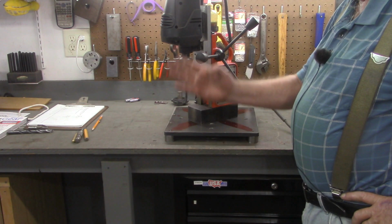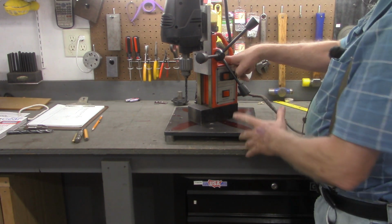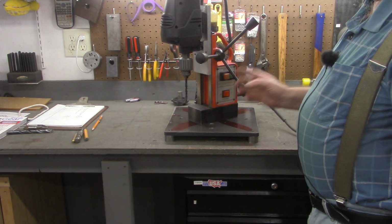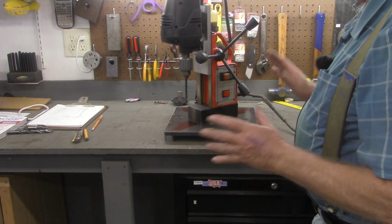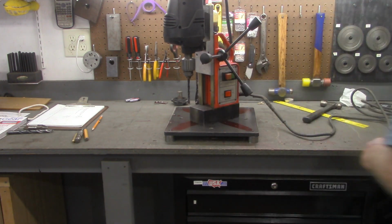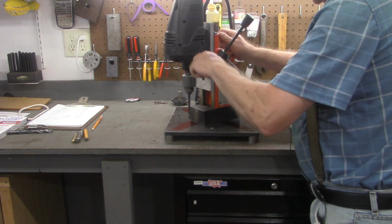Same thing on a vertical beam. If you got this at a 90-degree angle, strap it. Run a strap through this and around the beam, because you can trip your breaker. Something should happen in the motor here, the motor up here, the magnet's down here. But again, any number of reasons the power could go off. So always have it strapped down when you're either upside down or on a horizontal or vertical beam.